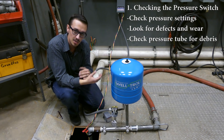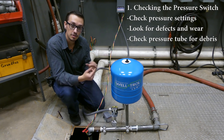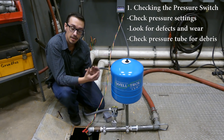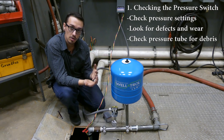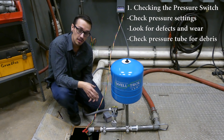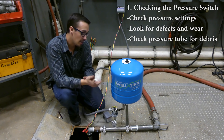Another level of check I could perform here is to run the pump through a cycle. In the instance that your motor is starting too often, the pump is able to run, so let's run it through a cycle and keep an eye on the pressure gauge. Watch whether the contacts are opening and closing when they should. If they're not, you may need to adjust the settings inside the pressure switch — we have a video on adjusting the pressure switch, so keep an eye out for that.